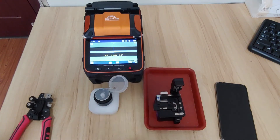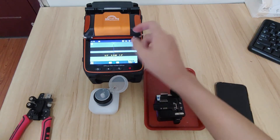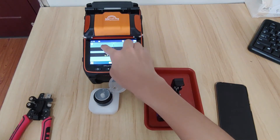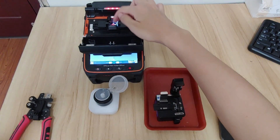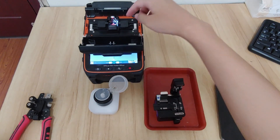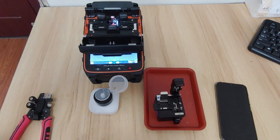That's a good state and the fiber will give you low loss. So if the fiber interface has a shadow, a gap, or something else, that means your electrode discharge voltage is not good. Check the firmware first, then do the ARC calibration — that is the normal way to solve this problem.